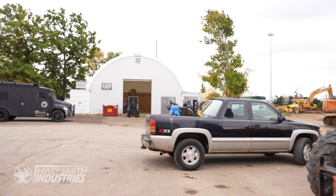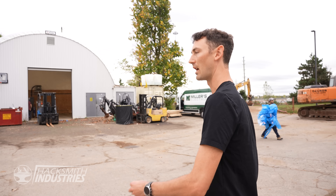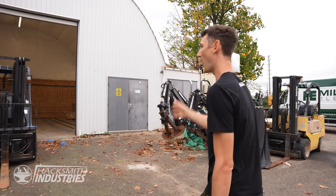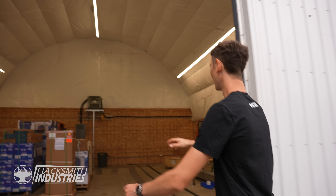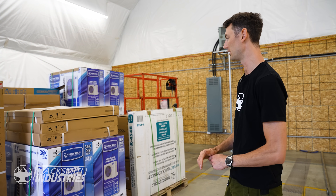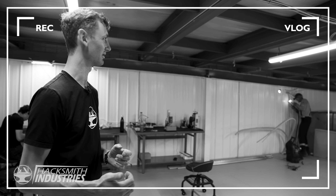Let's go to the tent — I'll show you what's going on. There are five machines showing up next week that'll go in the tents, and then another seven sprinkled out after that. We're almost done the infrastructure in the tents: it's fully insulated, it's fully powered. The next things we need to do are HVAC — which is what Mr. Cool is doing — and getting power to each of the machines. Each Mr. Cool unit is three tons, which means 36,000 BTU. They're fantastic because you install it all yourself with quick-connect fittings. A tech was in previously soldering together the lines and that bill isn't going to be pretty.